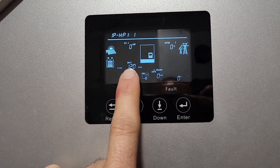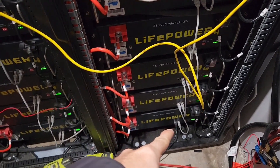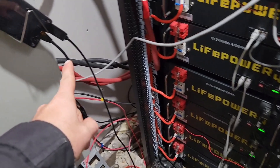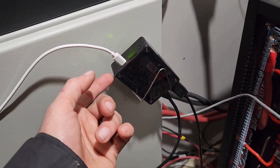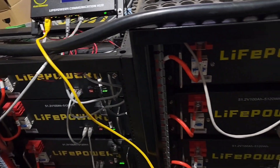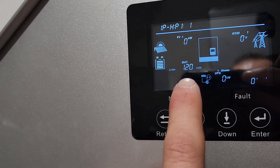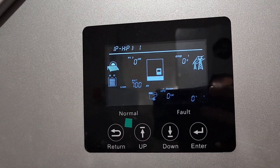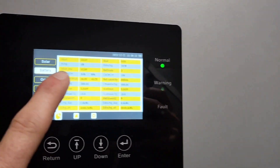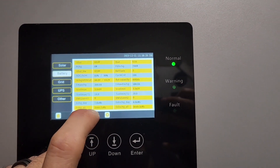Back over here we're still at 84 percent and zero kilowatts — there's no load on this inverter — but it's reading 1.2 kilowatt-hour storage. So I'll unplug this solar system cable. It comes up and into the Solar Assistant Pi. I have an Ethernet cable running for the Pi because the Wi-Fi sucks. I can still unplug this and it'll switch to 600 amp hours — 700... 600 — and it may take a minute.